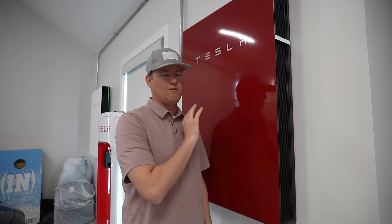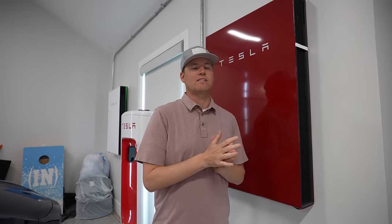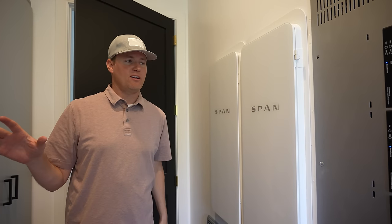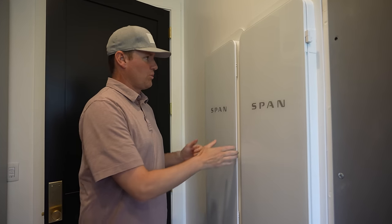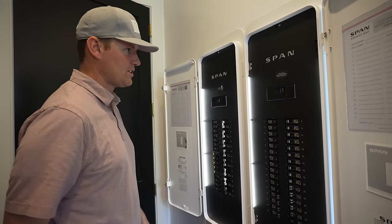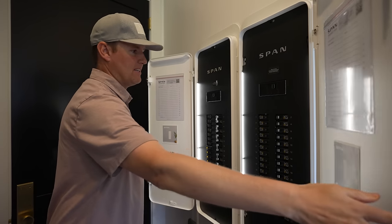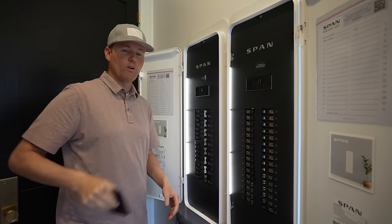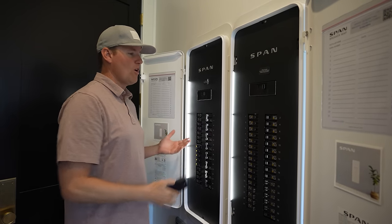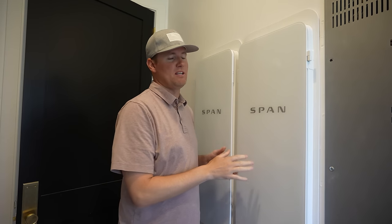We did a good job loading up in the daytime and feeding it out. I wish I had a lot more Powerwalls — probably four to six would be ideal for this house. That way we'd have enough to actually run the house when the power's off. But honestly, the real hero of the off-grid challenge is the SPAN panels — which is funny because this video is sponsored by SPAN. These smart panels connected to the app really are the thing that made it happen. Without me coming in here and physically turning off the buttons, I can virtually do it with the app to turn on and off different breakers or move them at different priority levels.